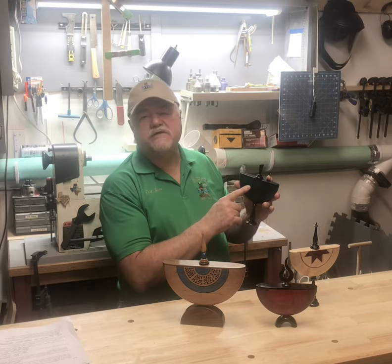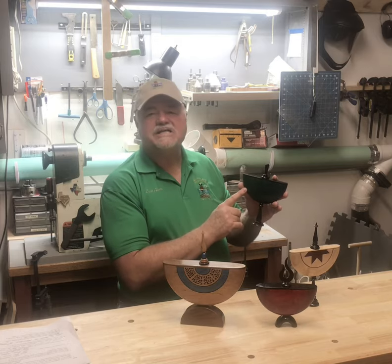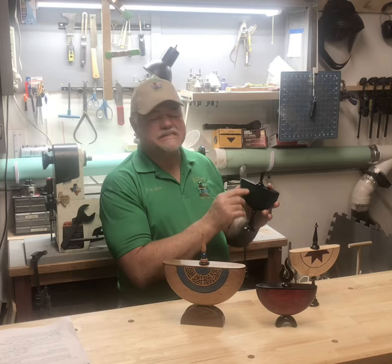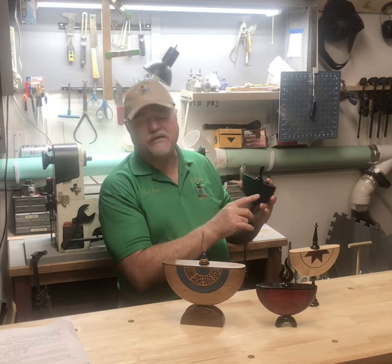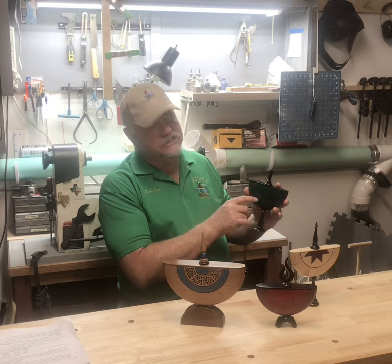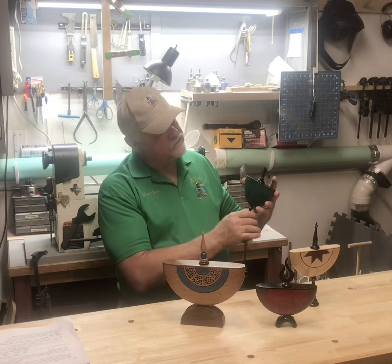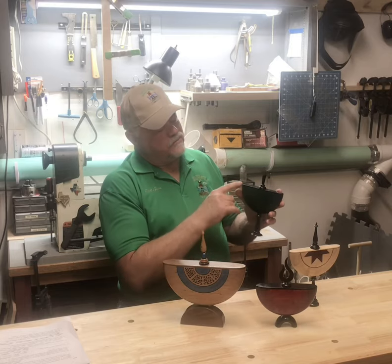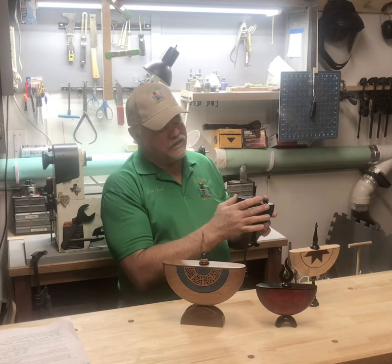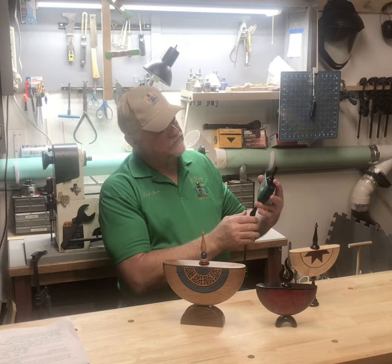And those of you that have done work with white oak, you know that it has a very open grain pattern to it. I chose not to fill the grain pattern. Rather than filling it, I just dyed it, and really liked the way that it highlighted those open grains. I also like the way that the flakes show up in it because it is quarter sawn. Really nice piece of wood. The black, again, with ebonizing lacquer, really makes it highlight the work that I did there.